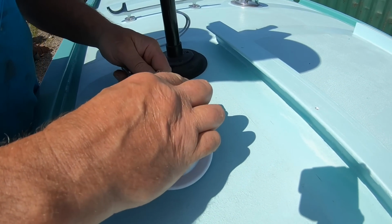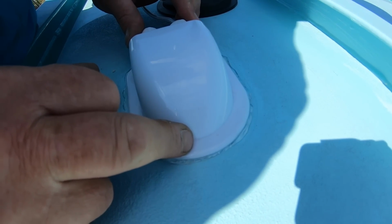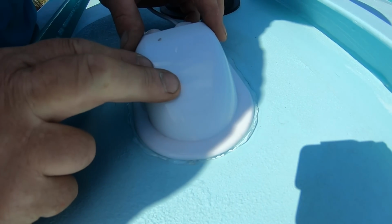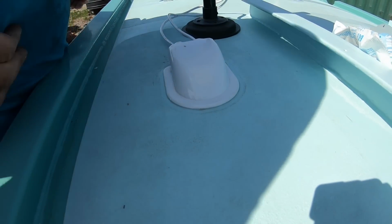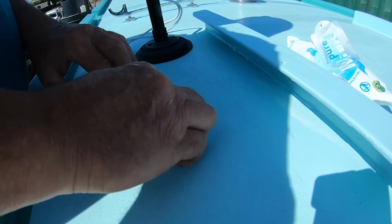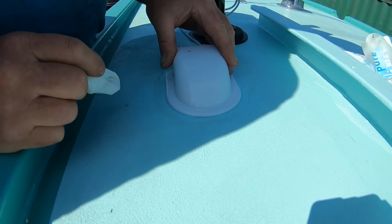I don't think his head could cope with any more butyl tape, so he's gone straight for the CT1 on these glands. You don't realise how traumatised I was at school with the plasticine. So this is for the internet aerial, antenna. And so these glands just help keep it watertight where the cables come through into the boat. On all the others, we've put some masking tape around the edge, save all this cleaning.